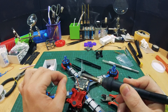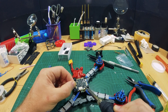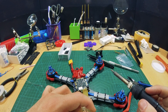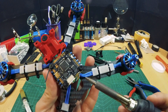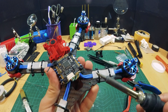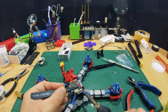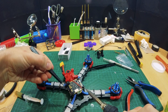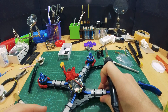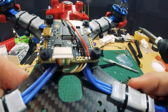Tin the ends. And now let's tin our pads. Touch it with a little flux because they're very close to each other and I want to make sure they're not bridging. Add a little flux and then touch it with a little heat. Let's use our tweezers — bring it in like so, hold it like this, bring it in there. Now the other one. Let's inspect that. Always inspect your soldering. That looks good.